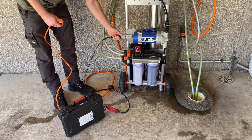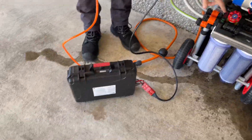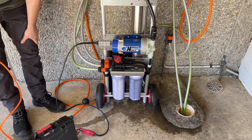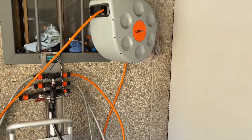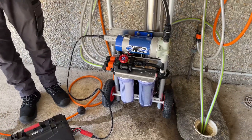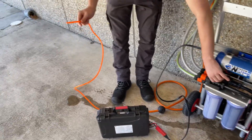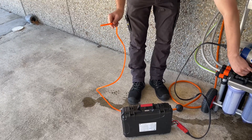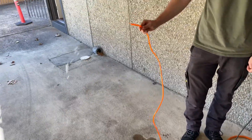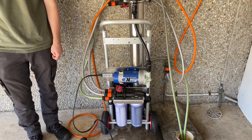Julius is going to go ahead and plug in the BTA lead to the Anderson plug, which all comes pre-wired when you buy the upgrade kit. This is the 120 amp hour battery pack that we sell at Window Cleaning World — we use this for testing. We've got a setup going through a hose reel to mimic using a hose reel, and some pole tube so we can show the different flow rates. Now that the air has been purged out, Julius is going to crank that waste valve down and we'll start to see water come out, probably with some air bubbles as well.